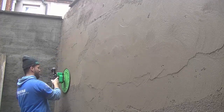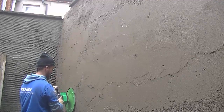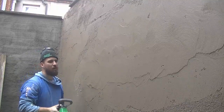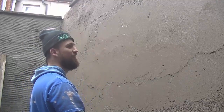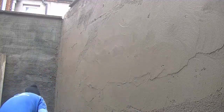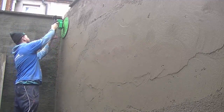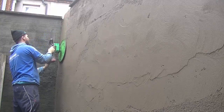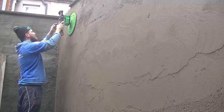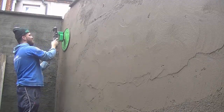Believe it or not, the wall did not take long to get on and straightened up. The background of this wall is red brick but there are also painted areas which didn't come off. Red brick normally has high suction, but with the SBR and stuff in the scratch coats and the paint on the brick, I think I did a real good job of holding it back where I've killed the suction. The very cold weather also has not helped. The top had a lot better drying — a wee bit of air was hitting it better and it actually did finish well with the power float.